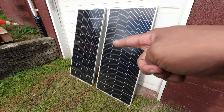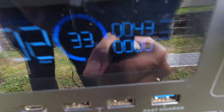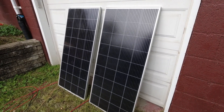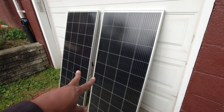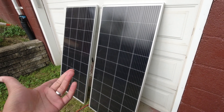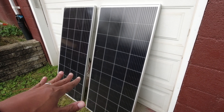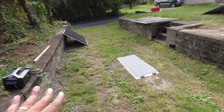The sun is not cooperating today, but I have those two panels hooked up. I just want to make the point that 180 or 190 — it doesn't matter, they pretty much output the same. You can see that one's getting 43 watts. These panels, no matter the rated output, are going to perform very close to each other. Typically across both of these panels I see about 130 to 140 watts.